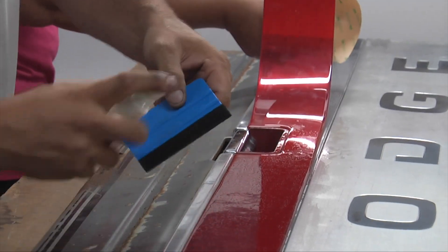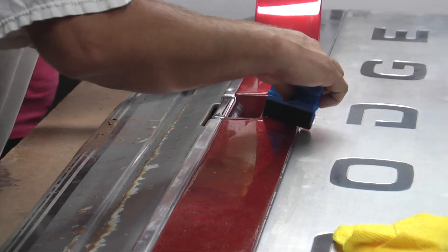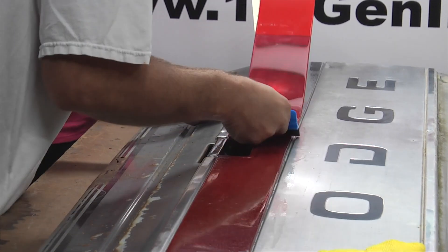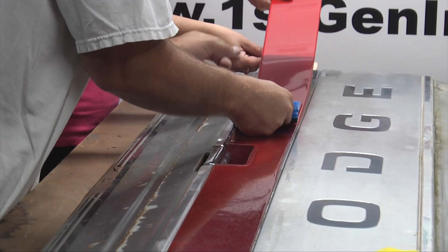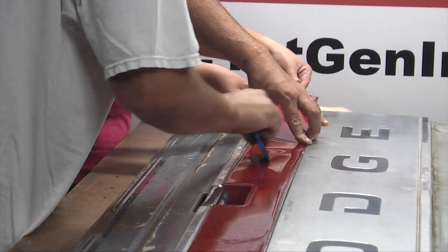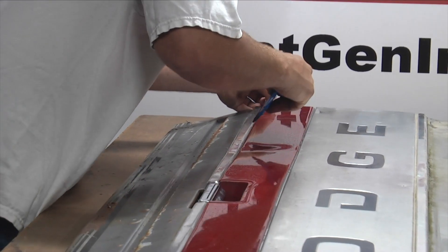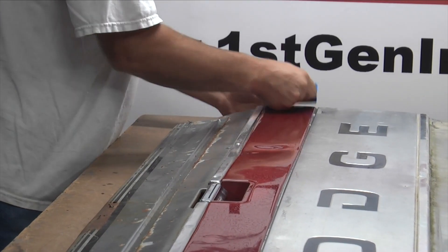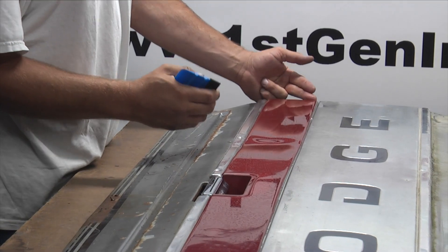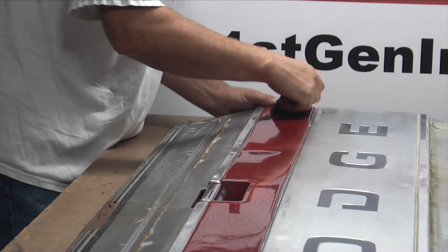Having the felt pad a little bit damp helps it glide — if you need to do a pre-spray on it that's not bad. This is a bit of a sticky material by nature of its design, so if it becomes too sticky it will grab on you. Make sure you stay square and aligned and then position the final end. This material will stretch a little bit. Although it's made the exact length to fit on here, you may have to adjust slightly — pull it and it will line up. Some of that is temperature-based because this material will expand and contract, but you won't need to pull it much; it should normally be within a couple thousandths.